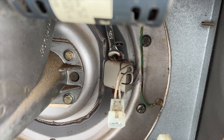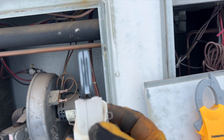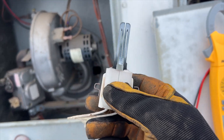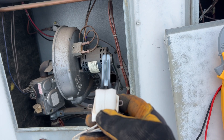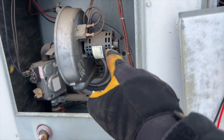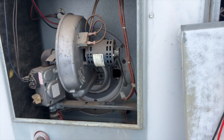I'm not going to put you through the pain of watching me do this. I got her off and she's white as heck. We'll test the new one and see what the ohm rating is, and see if 300-something is normal. It looks like this has been changed before because usually there's a gasket around there. The way I got it was using the wrench to loosen the two screws, then sliding it down and using my nut driver. Got the top one off, slid it up, got the bottom one off — that's probably the best way to do it.